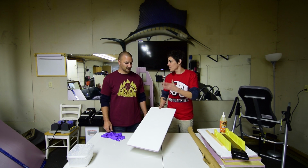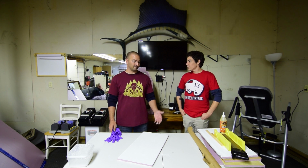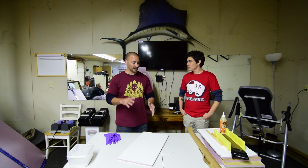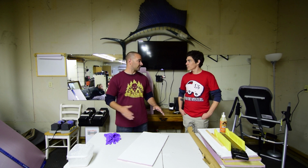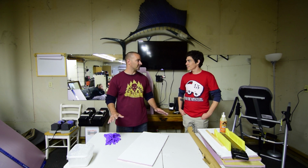So what is this method that you've got to... It's nothing new. It's normally done on floors. People want a fancy look on the floor. It's called the brown paper bag technique. You put all these ripped bits of brown paper bag, you glue them down, and you polyurethane over it. It gives it like a neat, old leathery look to it. It's really neat and unique, and each time you do it, it's different.